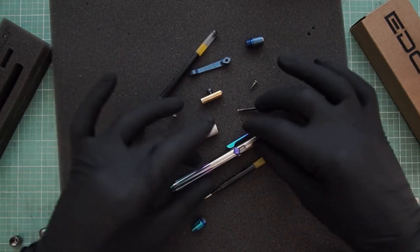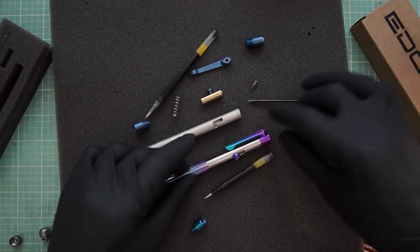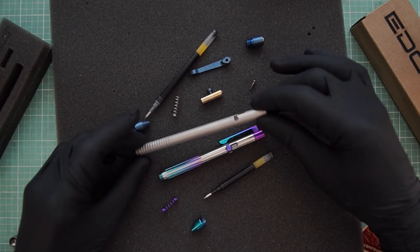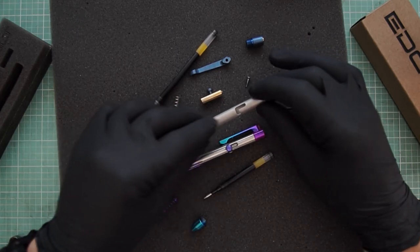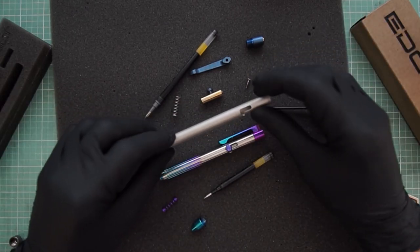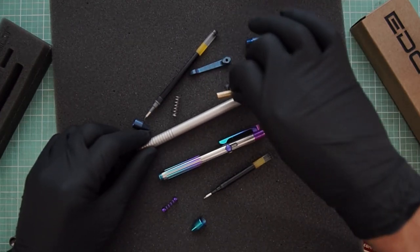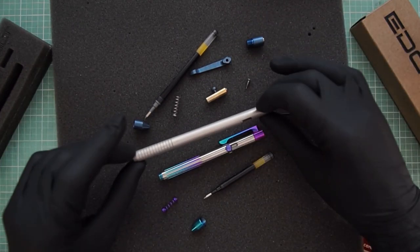Once I was able to do thread milling, I could do fun stuff by having this screw just unthread — I don't need tools to take anything apart. The body finish on this one was an acid finish; I basically dunked this in acid to give it a slightly frosted appearance. It came out okay, but I didn't do too many of these because that finish is not terribly strong, and it also etches on the inside of the body, which isn't ideal. In this case it worked great because the brass is so self-lubricating. I tumbled a ton of them and did a few polished ones.